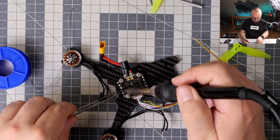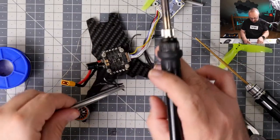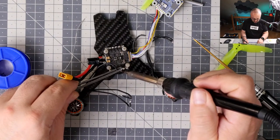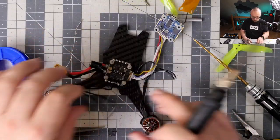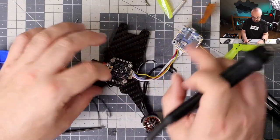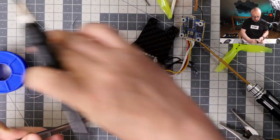All the drivers you require come shipped with Windows itself. Windows becomes just like Linux. All the drivers are inside. So that's that. What you can try to do to figure out what's wrong. First of all, use a different USB cable. And I'm serious about that. The cables are very often the reason of the problems that you think is something else. So first of all, try a different USB cable, plug into a different USB port, and in general, change everything.